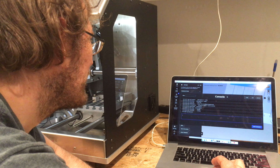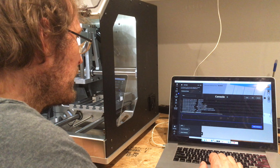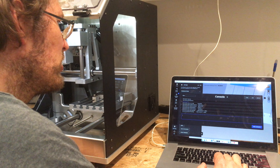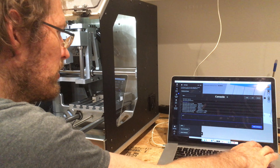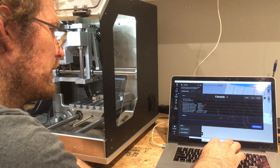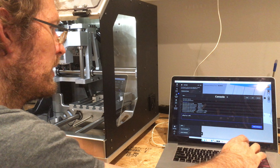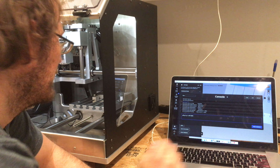They have a lot of debug information in here. The Y-axis max velocity is 5060 mm/min. Let's try that with X — we'll do G1 X... let me set G90 G21 and then G1 X-minus, there's got to be at least 200mm there, at F5000 mm/min. Enter does not send the command.